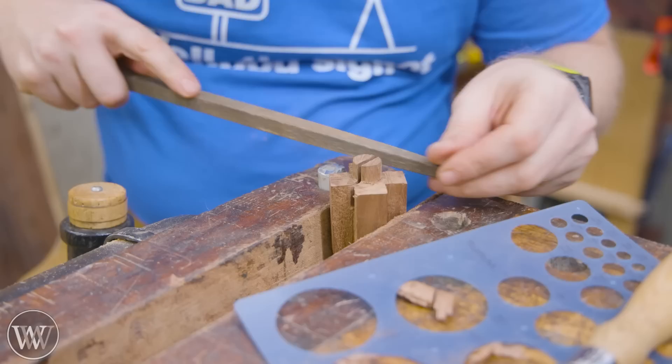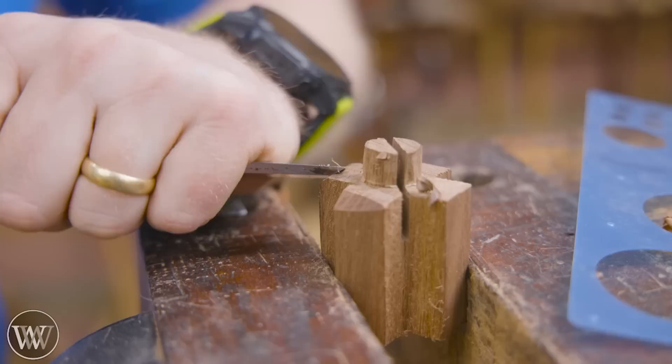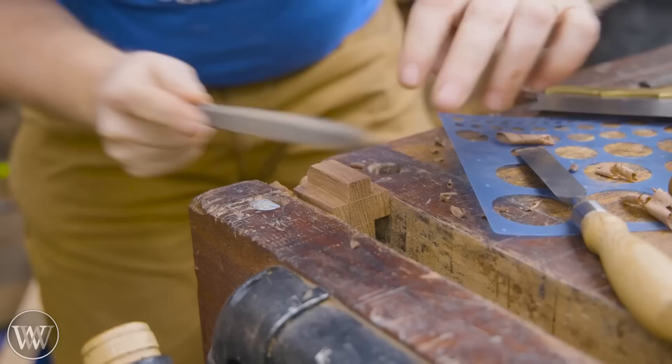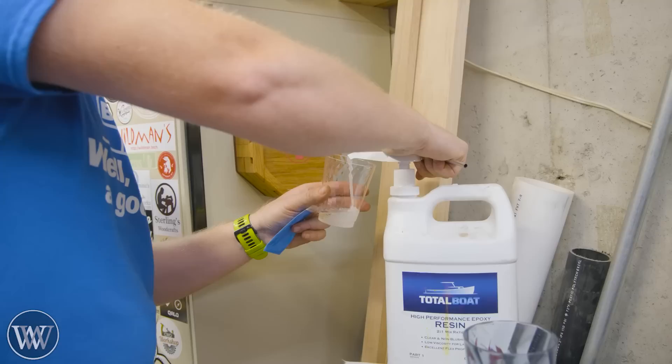Once I get it down deep enough, I'm going to start doing some of the detail work before gluing this all together. I want to make sure all of my shoulders are the exact same height, so I'm going to come in with a chisel and clean them up. The saw stayed a little bit farther away from the line on one, so I can detail that down, then come in with the file and smooth them out — transitioning from one shoulder over to the other, trying to get them close. Before finally gluing them up, I'm going to chamfer all of the edges because I don't want to do this after I have the collar on there. I'll run files down each of the flutes inside and clean those up — just smooth out all the surfaces I can before gluing it up.